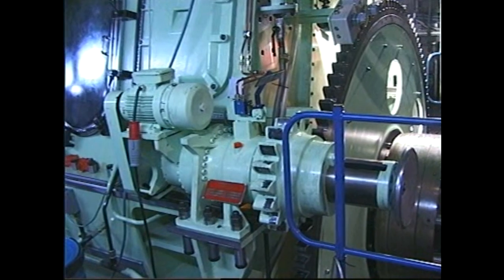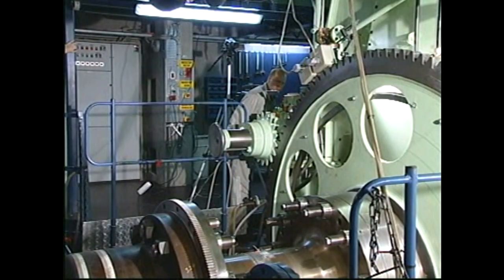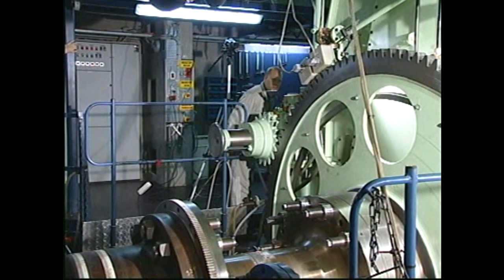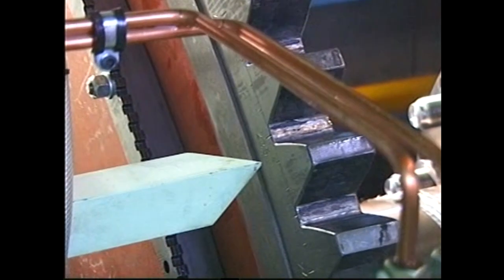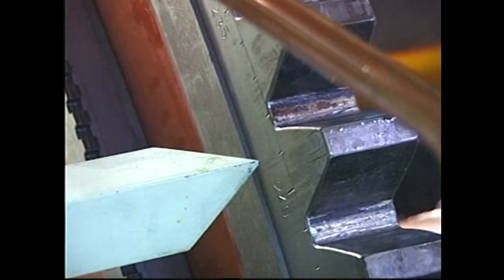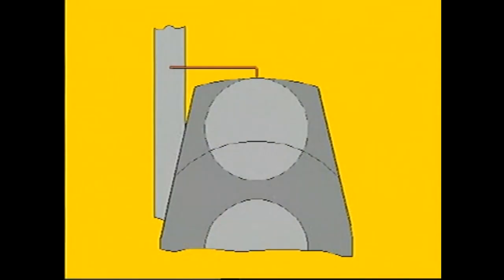The position of the crankshaft has no relevance with regard to the checking and replacing of the trigger pickups. However, before checking and replacing marker pickups, the crank throw for cylinder number 1 must be turned to the top dead center position. Check the top dead center position at the turning wheel and confirm it by means of a pin gauge measurement in the crankcase.